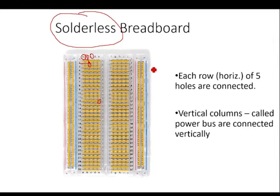So it is important. But again, I want to remind you that in the full board, some of the boards, you may find it is connected only halfway. So this yellow, you can fix a wire here, expecting it's connected to a wire here, only to find that they're not connected. So be careful when you're dealing with those full boards. Some of them, especially the latest versions that I'm seeing in the market, are not connected at all. Okay, so I think that is very, very important.